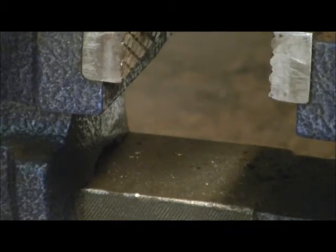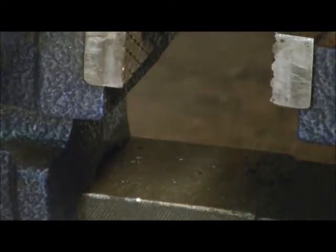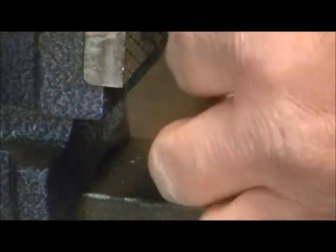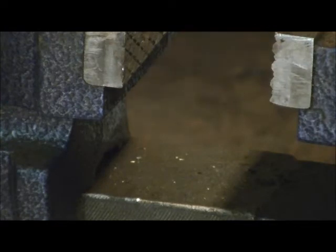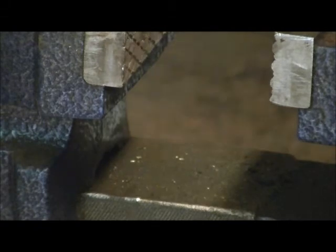This is part two. And the idea to get these grooves on each piece is to let the bead from the weld go into the metal. Gives a little bit better penetration, but also gives it more strength because you're adding more metal through to the inside between the two joints. And you do that on both sides, and then your side pieces here, you just run a little bit of a bead just to seal up those sides so that it has plenty of strength this way and this way. So then you've got good total strength all the way around.